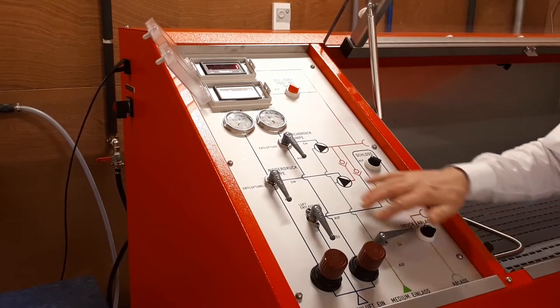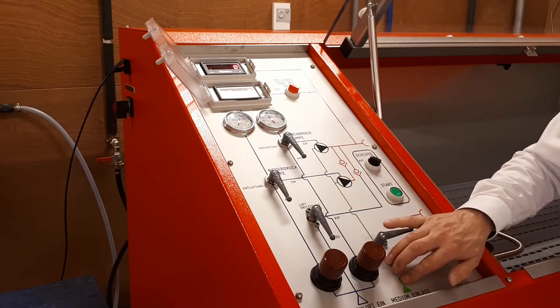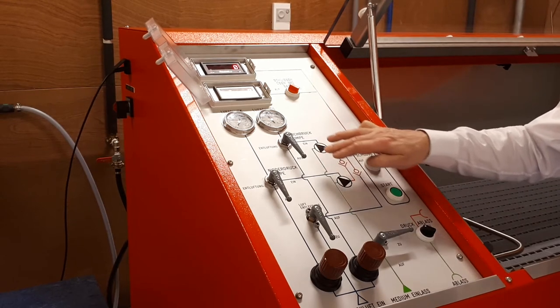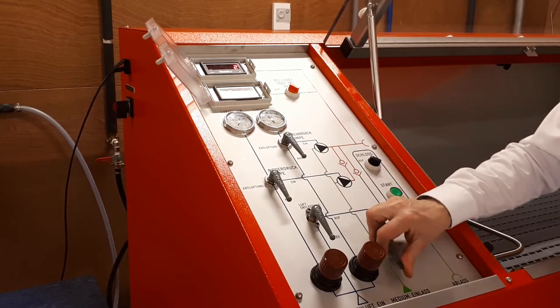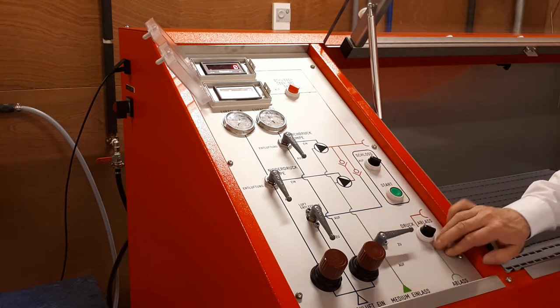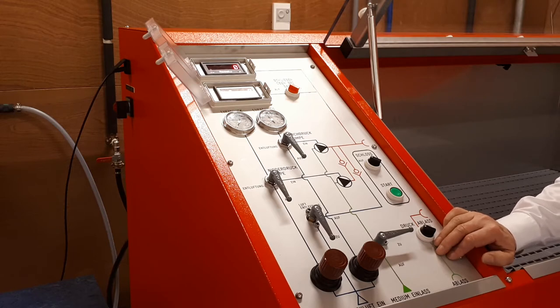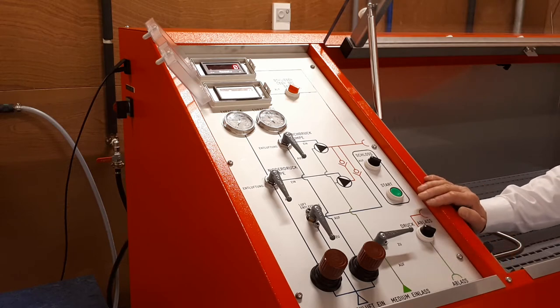About the green lines: the first green line stands for the water feed to the pumps by opening this ball valve. The second green line stands for the visual de-air indication, which is used at the beginning of the test, and the high pressure bleed at the end of the test to release the pressure on the hose.